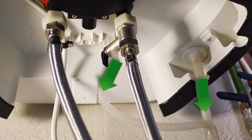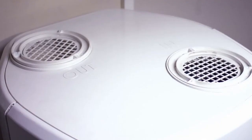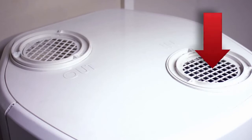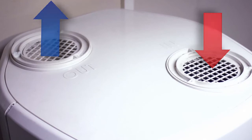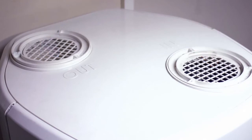On the top of the product is the air inlet and outlet. The higher the air temperature entering the equipment, the better the performance of the heat pump. Once the air has transferred its heat to the coolant, it leaves the equipment between five and ten degrees cooler compared to when it entered.